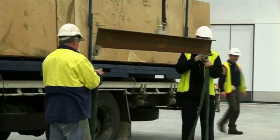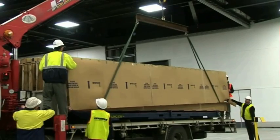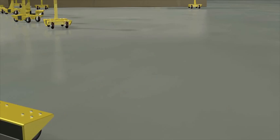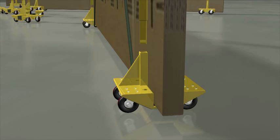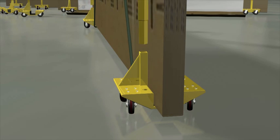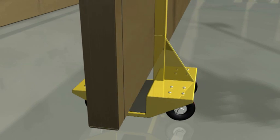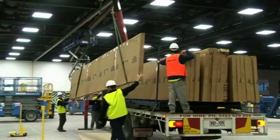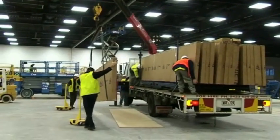Three stillages fit on a standard truck, delivering 18 panels to the site per truckload. The truck must have a crane fitted for removal of panels using a spreader bar. Unloading time with a crew of 4 men should be about 30 minutes per 18-panel truckload. Make sure that sufficient yellow trolleys have been pre-delivered to the site and are at the unloading area. Ensure the truck's outriggers place a tilt on the tray, preventing panels falling out of the stillages and onto the workers as the shoring bars are removed.